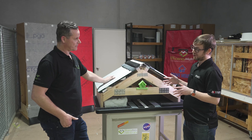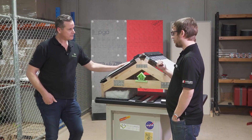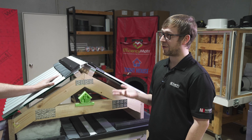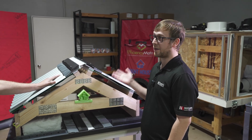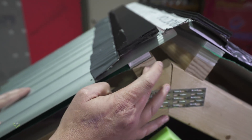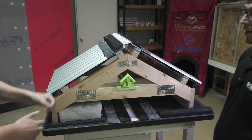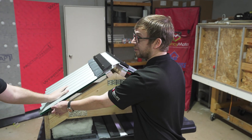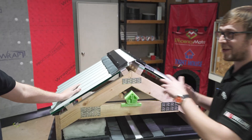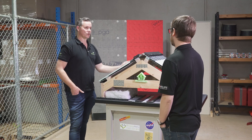The roof space itself is not a space you really want to heat, so you want all the heat generated inside the house to stay within the habitable zone — it's a waste of energy to heat up that extra volume above. The anti-con blanket's overheating reduction works by ventilating that space, with air movement carrying hot air back out again, especially above the sarking. Having that ventilation space between the roof and the roof battens gives you significant air movement that rejects the roof's energy before it actually gets into the roof space.